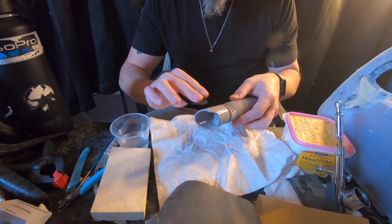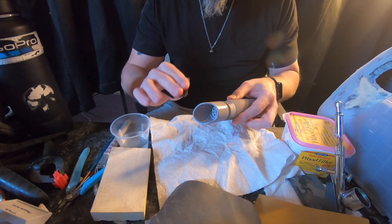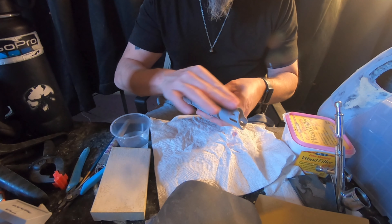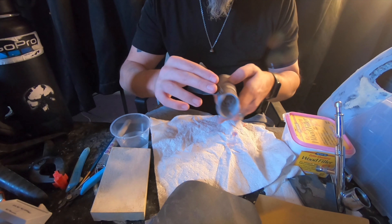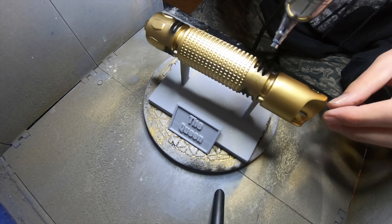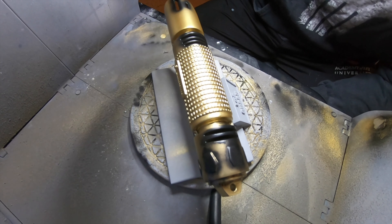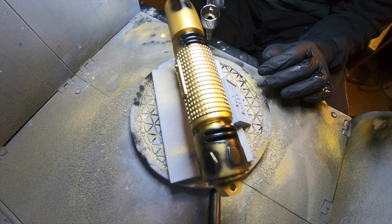Here's the stand. I just wanted to show what you can do with UV resin. This is some I had left over from another model — that's why it's dyed. I go and fill in these gaps because this was printed out in pieces. I put it in my curing box for about five to ten minutes and it's good to go. Then I start sanding it, which is relatively simple, and it's great for smoothing things out and filling gaps when you don't want to use a certain filler.